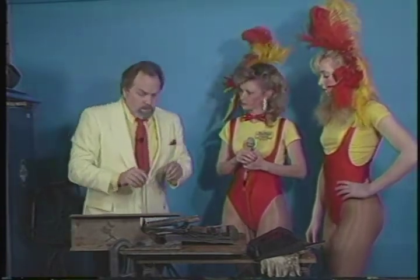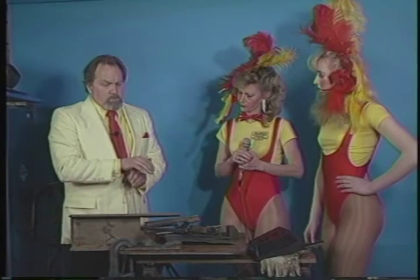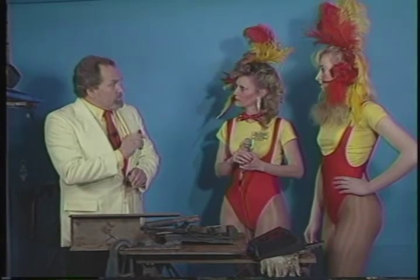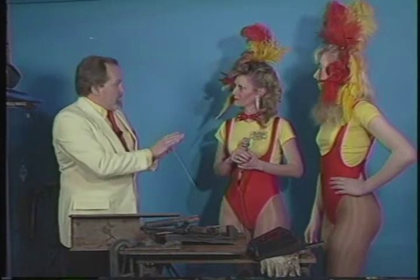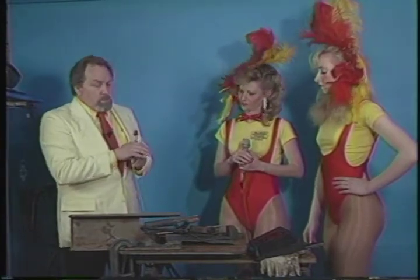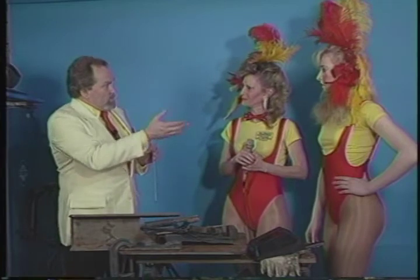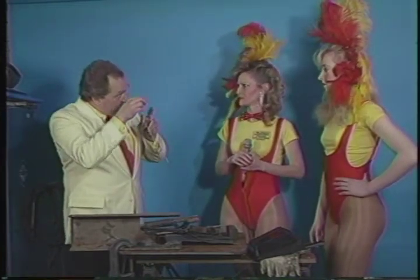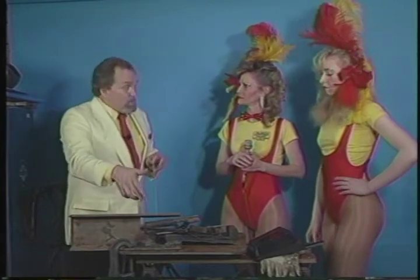And one of the reasons why I insist, if I get involved, and I've done it many times over the years, of teaching someone how to weld, is that they learn how to oxyacetylene weld first. Reason being, for a dozen reasons, but one of the main reasons is everything happens very slowly. Angie, you were practicing with the puddling. You saw it took time. It took cherry red hot, and then you actually saw the little puddle develop and all that. Whereas this does it almost instantly.